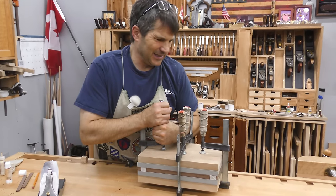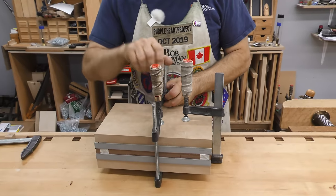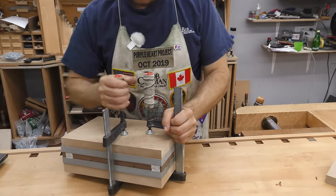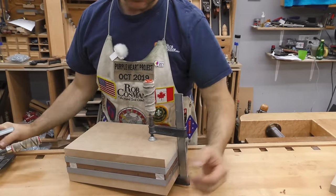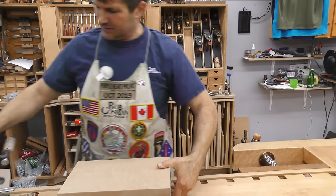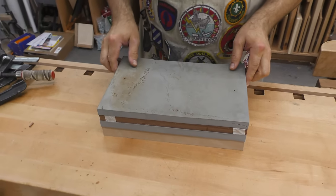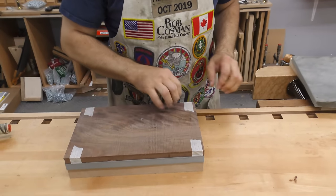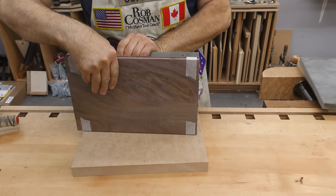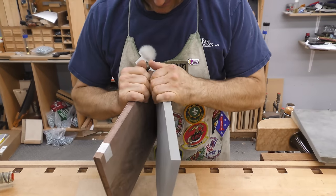I took off most of the clamps but wanted to save the last four for when we film. See what kind of spring back there is on that rubber. The fact that the clamps are still tight is good — that's the problem with some of the other materials: they squeeze and then don't push back, so you don't have any pressure on your glue-up. No hollow spots. This is the one where we didn't think it was going to stick — that's the little repair job we did. Probably should have put a piece of tape on that.